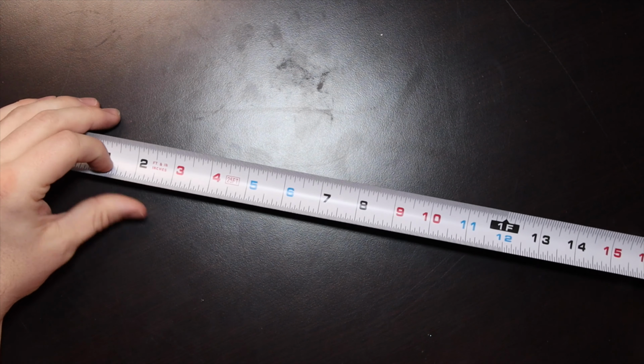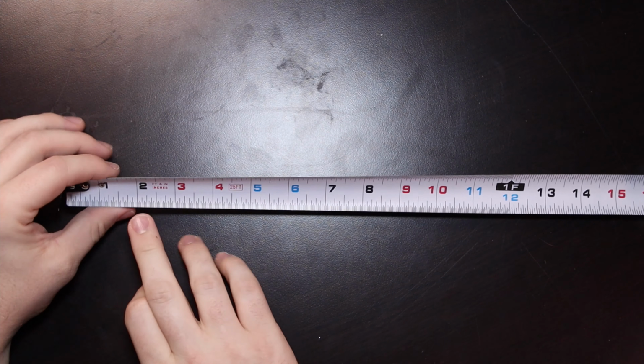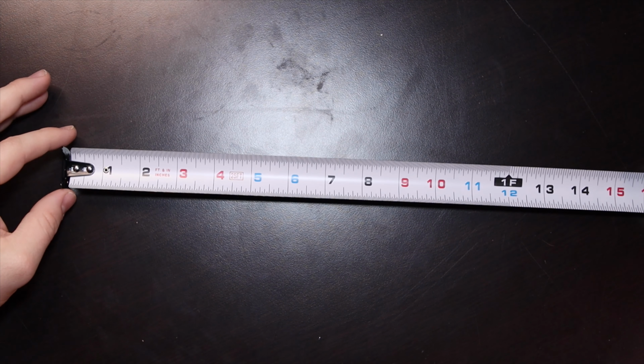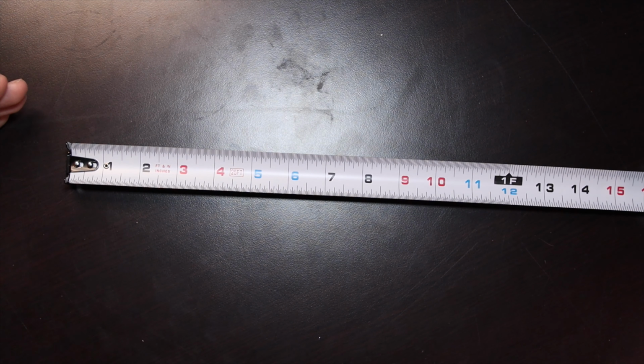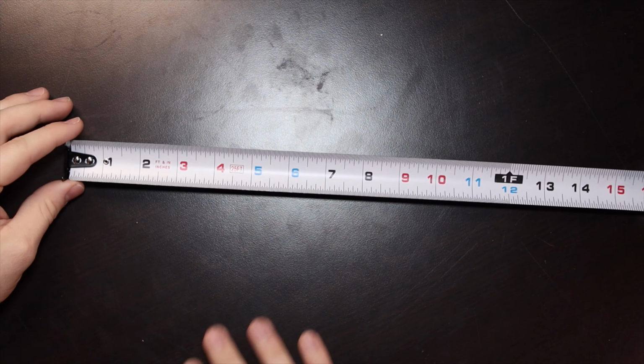I like that. Now with the phase, I'll tell you guys, for those of you who don't understand, black, red, blue are the phase colors for a 3-phase 120/208. So when we look at this, it goes in line. It actually just has all your phase colors. So you know if it's circuit 1 and 2, it's black. Circuit 3 and 4, it's red. Circuit 5 and 6, it's blue. This doesn't seem that important until you get to like circuit 67, and you're like, wait, I don't remember. And now you can look at it and see it's black, because your odds are going to be on your left and your evens are going to be on your right.